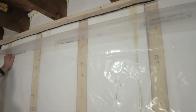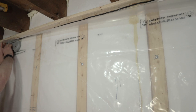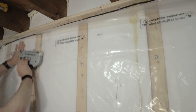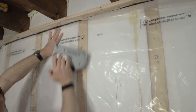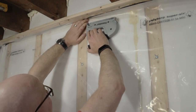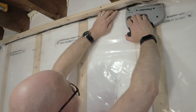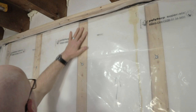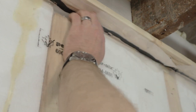Because I am doing vapor barrier, I need to run some acoustic sealant around the perimeter, and then I have a spot to drive some nails in. I will drive some and show you what I think of it. What you'll notice is that the stapler does a great job of driving the staples into the strapping through the vapor barrier, and also because I have 12 millimeter staples it staples well into the styrofoam itself. However, I did have a problem — I did get some frequent jams with this stapler, usually when I'm not quite flush to the surface with the whole stapler, so in hard-to-reach areas that was the worst.